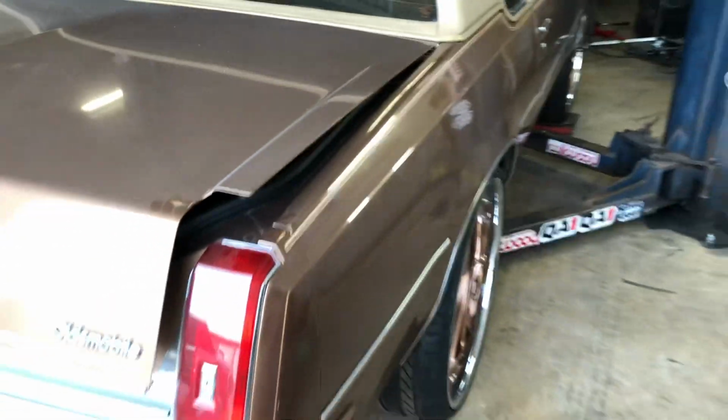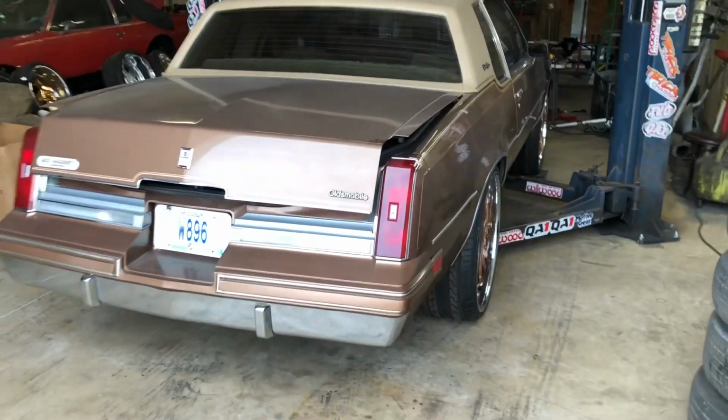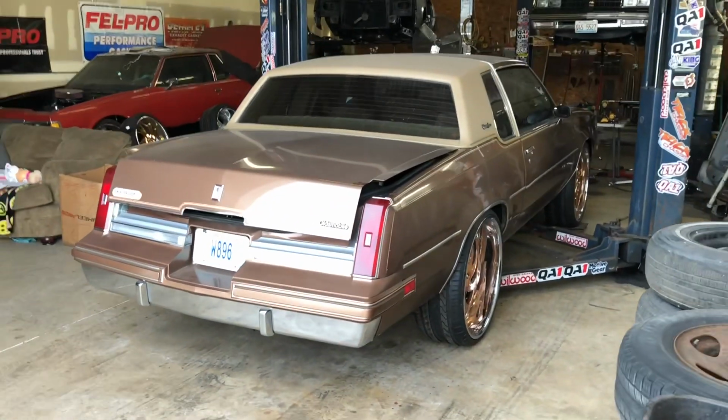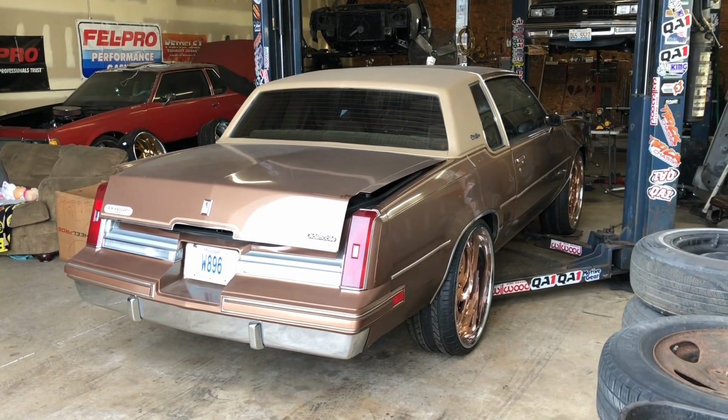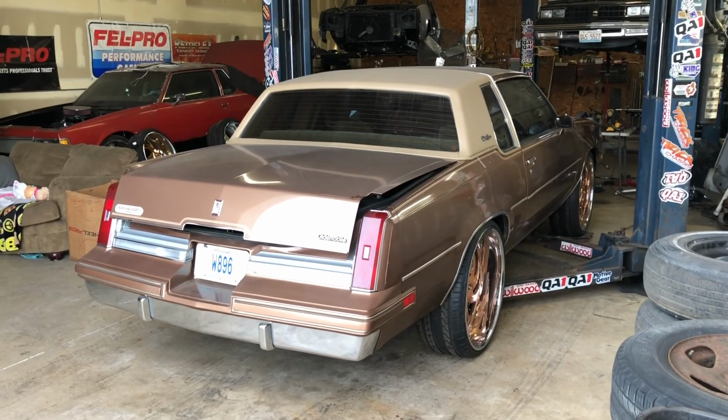If you guys keep the wheel as skinny as you can with fat lip wheels in the back on Gbodies, that'll save you some time. Always test fit your wheel first before you think you need to get mini tub and all this and that.